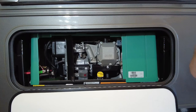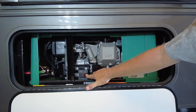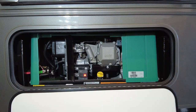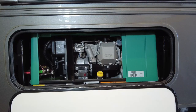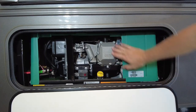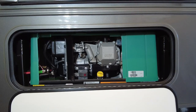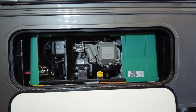I can start it up from out here — just hit the start button and we'll let that run for just a minute, then come back and check it. It should be good and warmed up. You don't want to run it very long without the cover on because that helps with airflow and cooling, but for a couple minutes it's okay. Before we button that up, I'm going to let the oil drain all back down, check the oil one more time, then check underneath the drain plug area to make sure it all looks good, put the little cover on, and we should be good to go.